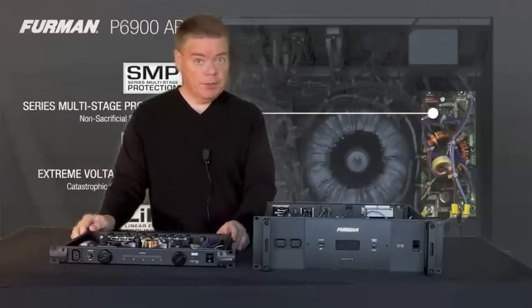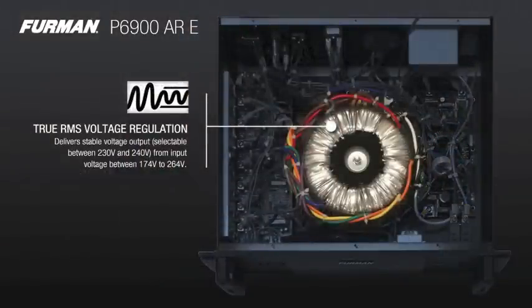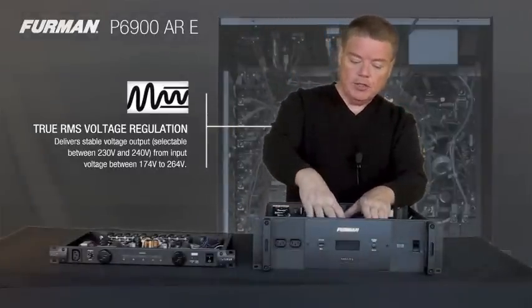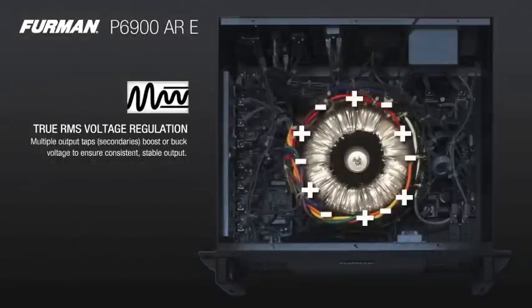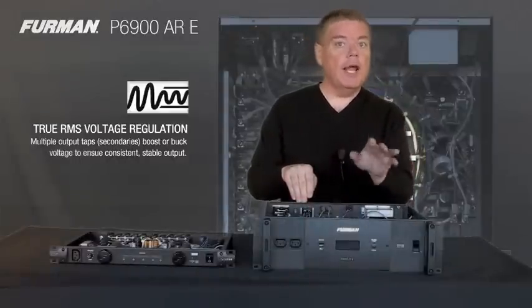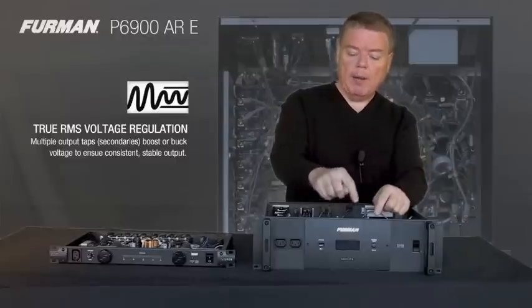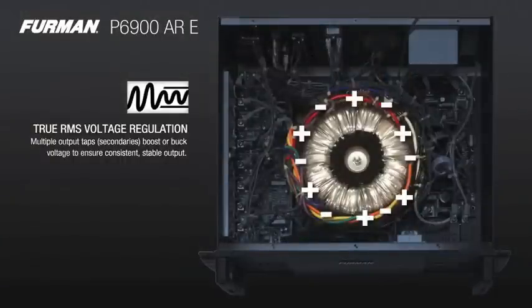Also linearized filtering. The big difference with the voltage regulation, besides it being a much larger profile and far heavier, is the fact that we have this voltage regulation system. By physics, this is going to take up some space. We have essentially a type of transformer called an autoformer — an auto transformer. Along with the aid of a microprocessor, it detects in fractions of a second the incoming voltage compared to what the outgoing voltage needs to be — 230 volts or 240 volts, at your choosing — and it compensates for these voltage differences by moving to various taps around this large toroid transformer.